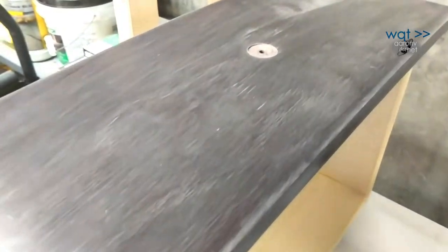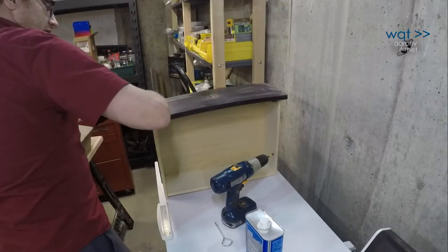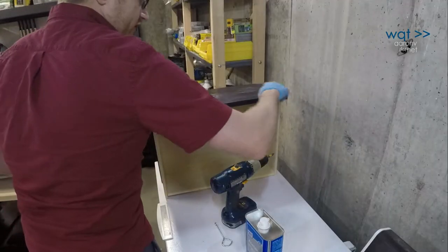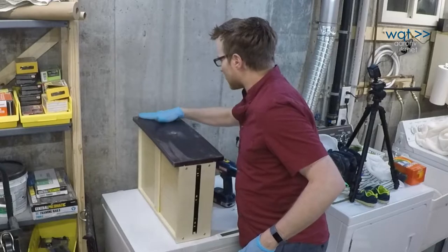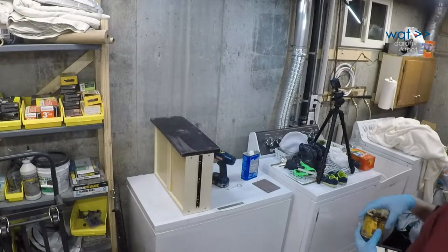Okay, that'll about do it for that step. Now, you'll notice I've left behind a lot of damage, and we can start to see where I've cut through the lacquer a little bit far. There was a deep scratch here already that was not entirely visible, but I didn't cause that, that was already there. And of course, then we have some residue marks still left over here where the sticker ate into the finish. Next step is to get wood refinisher.